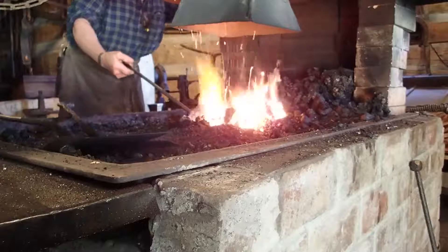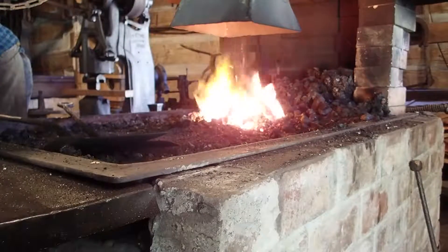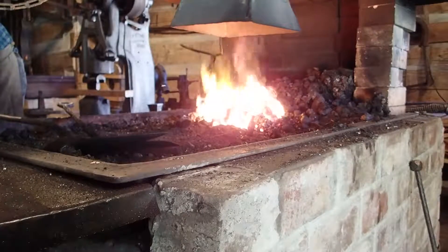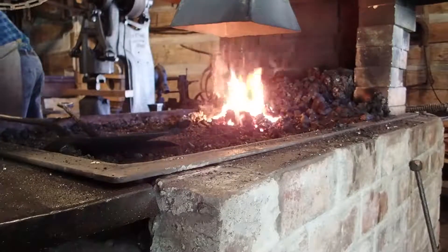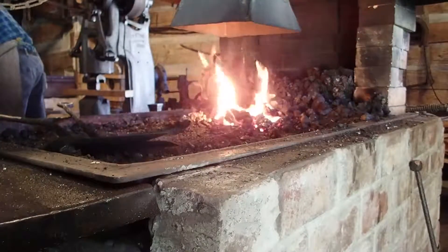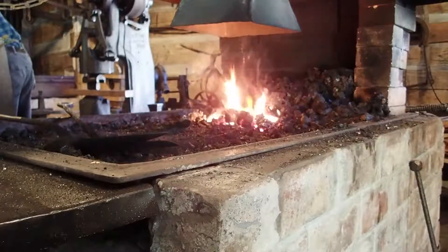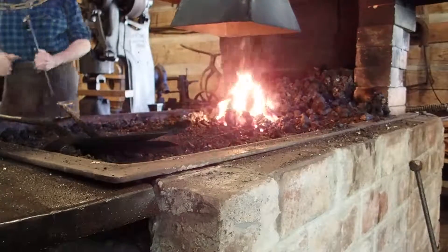With too little heat or temperature on the iron, the iron would be so hard — so much of the metal would be a solid — that as he pounded on it with his hammer on the anvil, the metal would tend to break instead of bend or deform. So he would have a much more difficult time shaping the metal.